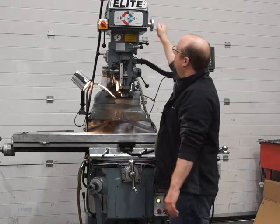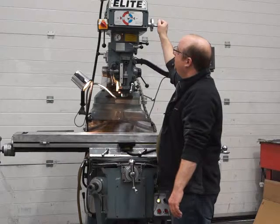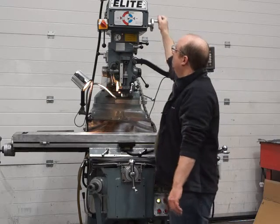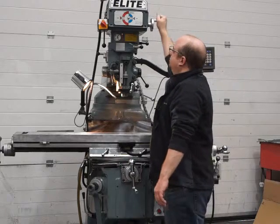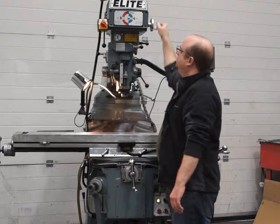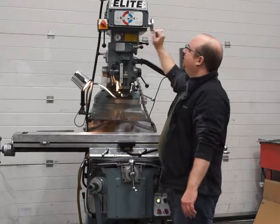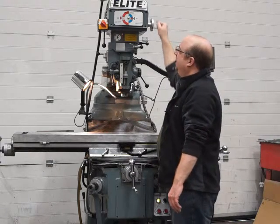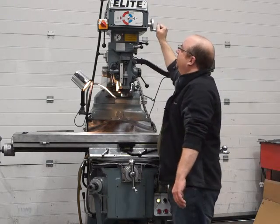Going all the way down to the lowest and all the way up to the top spindle speed — on this machine that's around 2,025 RPM at the last safe increment. It does actually say 3,500 RPM on the dial, but after 2,100 it goes into the red, so that wouldn't be a good idea. It does go up there but it doesn't sound right, so I wouldn't recommend pushing it that far if you want the machine to last.